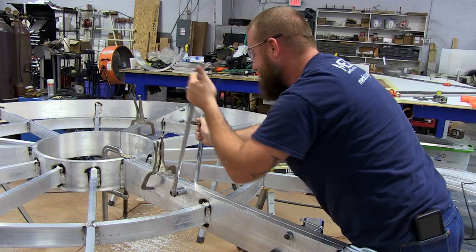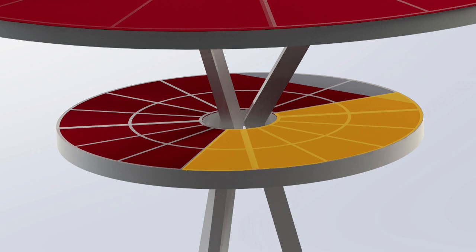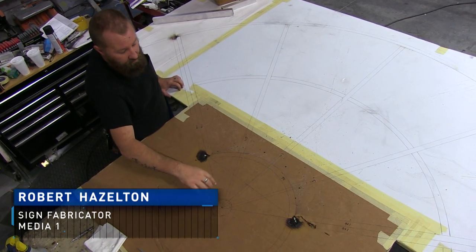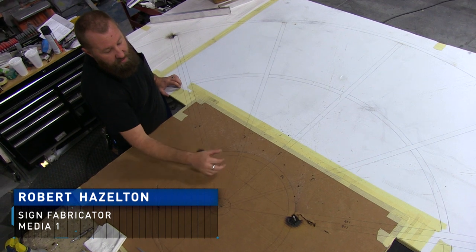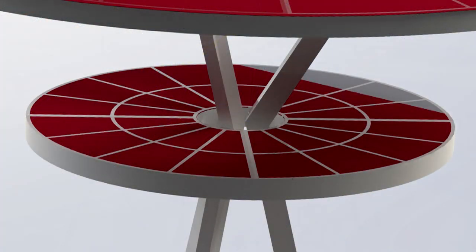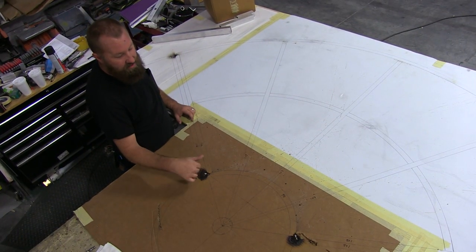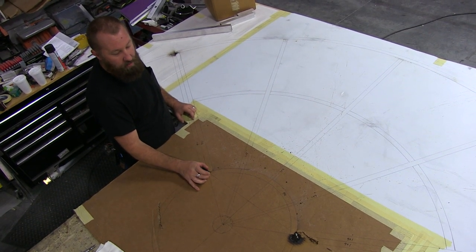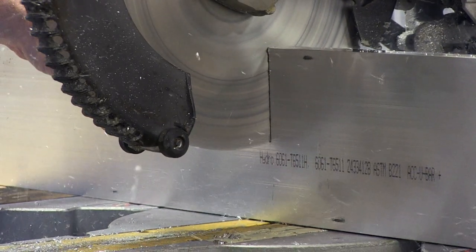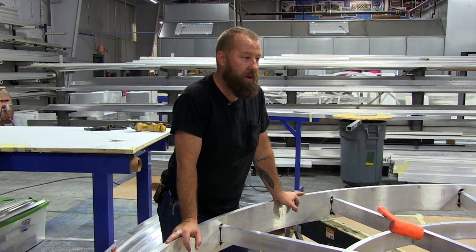This has actually gone pretty fast. Once I got everything laid out and remembered my high school geometry. The way I laid out the three sections for the smaller ring — I started laying it all out off the middle, laid out where the one-by-six on the inside is, then segmented that out at 120 degrees and then at 30 degrees. I physically laid out all the marks so I could get the measurements and have reference points to get the bigger pieces of one-by-six on here, mark them on the inside and outside for the right angle, then take them to the saw and cut — that piece times three, the outer piece times three, and then all the framing pieces. It's a challenge because it's really big, really heavy, and an interesting design.